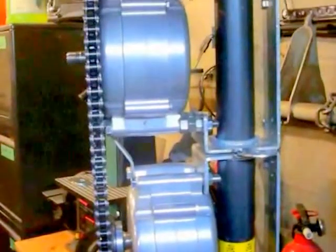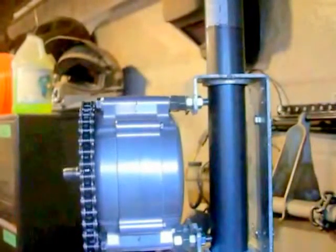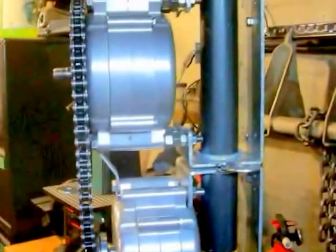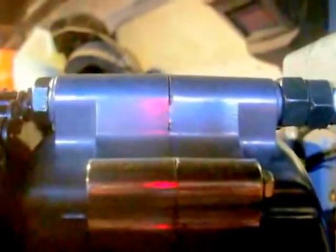Grinding down the blades kind of sucked, but it makes me wonder if I should have gone with my own rotor on top so I wouldn't have to worry about that. It is what it is — maybe it will inspire someone to try it. I haven't seen any on YouTube. As for pulling the stator out of this new PMG, that was pretty hard to do — I actually had to pound a knife in to start splitting the case. They're pressed together so hard, and that's after I pulled the screws out. I got her out and she's sitting over here on the table.